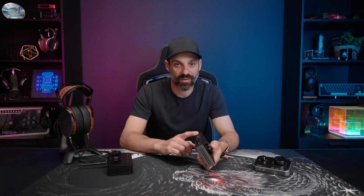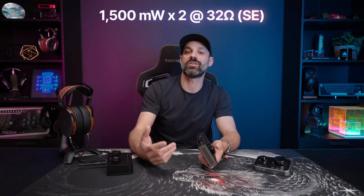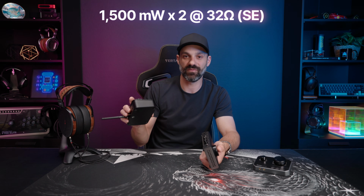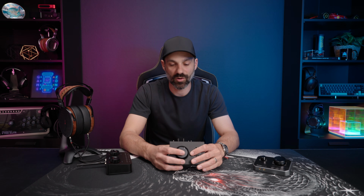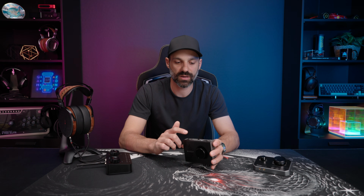This has 1.5 watts times 2 at 32 ohms in unbalanced mode versus 550 milliwatts. So this is basically about 3 times as powerful in unbalanced mode. Great sound quality. I was really happy. This uses an ESS DAC, very neutral, really good implementation.